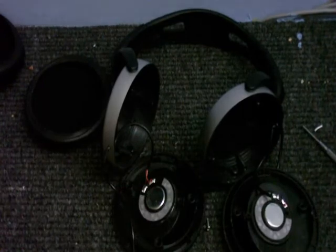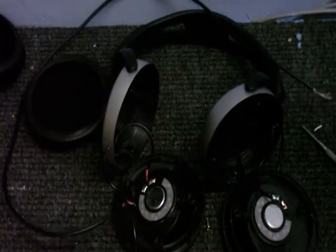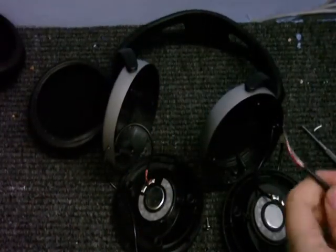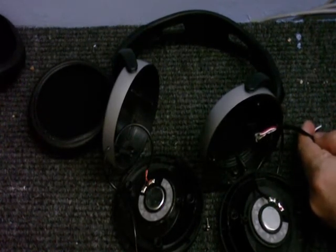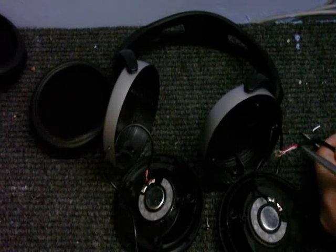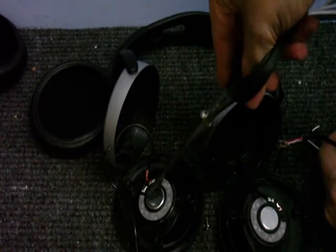You can see the two individual speakers now. I'm going to make it so the cord only goes into the left earphone. I've got some two-core screened wire right here. What I'm going to do is put this wire in here, where that wire is. That's going to be wired to this speaker here, and then I'm going to make a wire that goes all the way around there and connects to this speaker here.